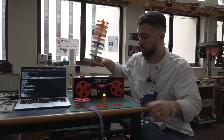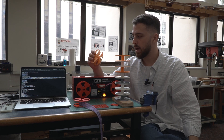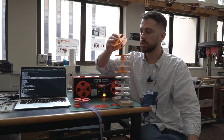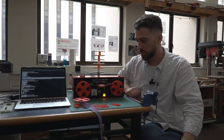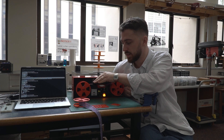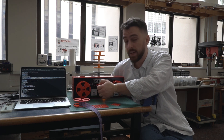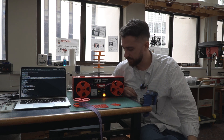I also iterated a lot on the reel, because that is part of the physicality of the machine — the physical logistics of getting this to work. These are a lot of the iterations before I landed on the final one, covering everything from how it spools on to how it interfaces with the axle. Currently I'm getting 99–100% accurate readbacks, though it really depends on light conditions. I'm going to work on shading this better because sunlight is full of infrared itself, and I get better results in a non-naturally lit room or if the machine is better shielded.